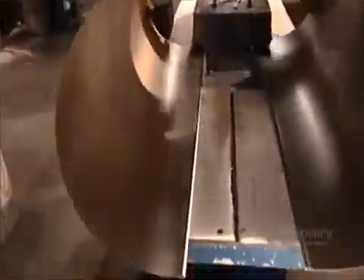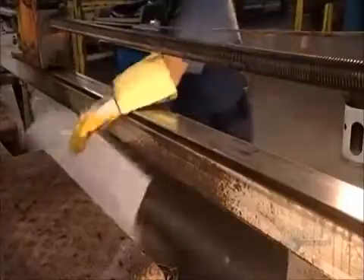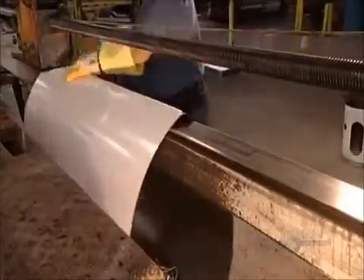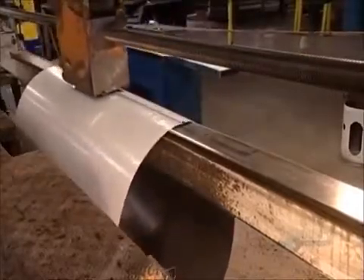Now, it's time to make the tank's outer shell, or jacket. An operator slides a painted steel shape onto a mandrel so that it becomes cylindrical. A lock former then moves along a rail, folding and pressing the seam together. Next, a roll former crimps the top and bottom edges so that lids can be easily installed.